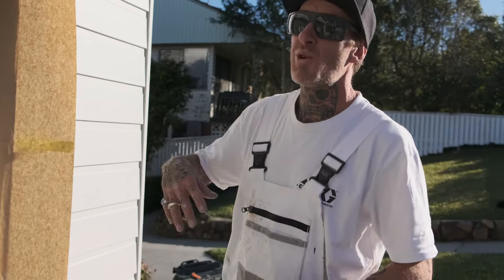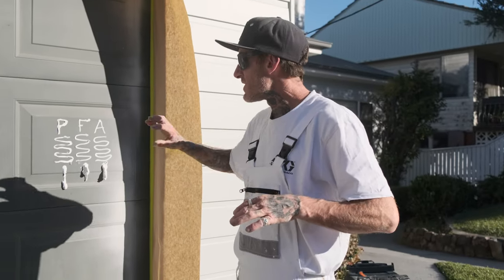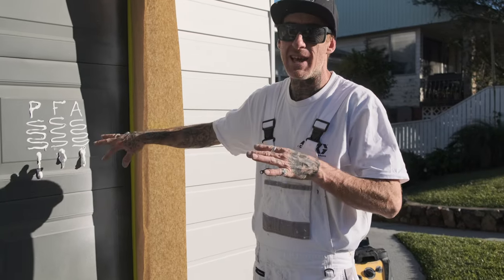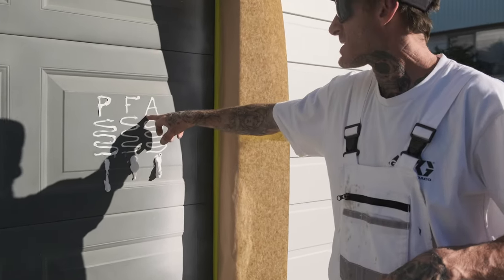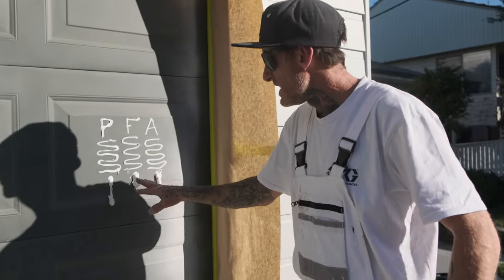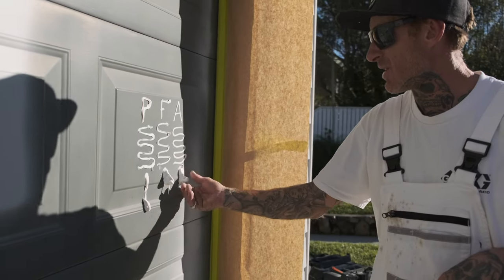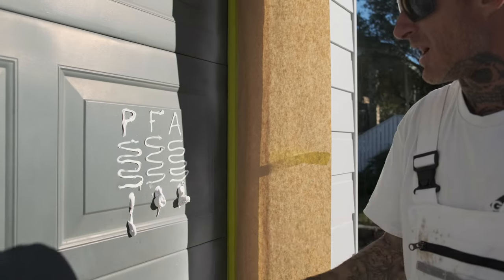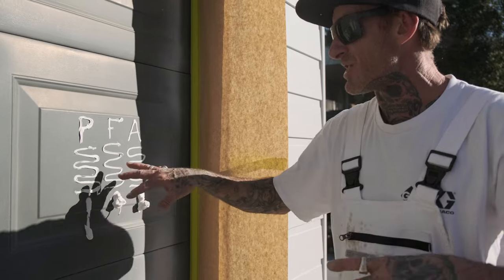All right, so we are back. We've left it about three hours. I've done this video before but didn't end up finishing the whole thing, so I left it overnight with that one, but with this one it's only been a couple of hours - it still hasn't completely cured. So this is the All-Weather Flex by Sedol, this is the Fill and Paint by Sedol, and this is the Polyfiller Original. As you can see, I did end up squeezing out more on both Sedols because I didn't want anyone to think I was being biased. I actually did squeeze more onto these chunks than what I did with the Polyfiller. You can see already that the Sedol has held its shape a lot better - it's got better adhesive to the surface.